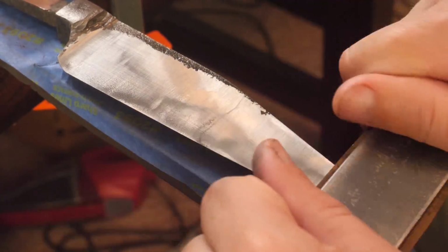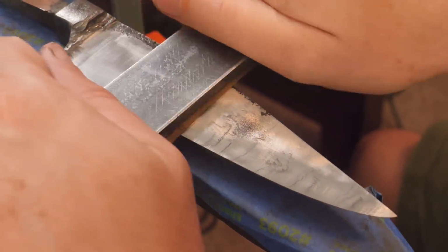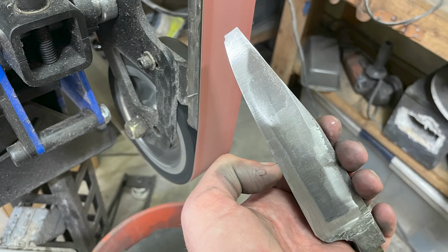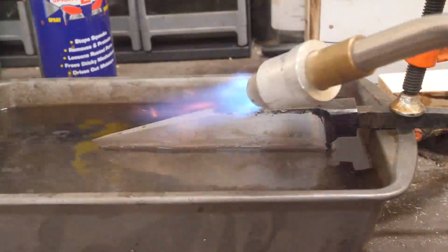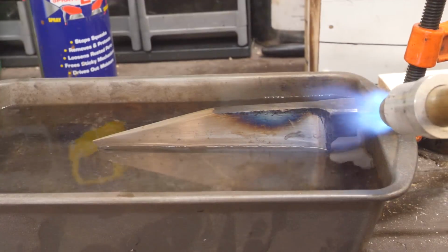Now oftentimes when hand sanding, one uncovers divots that require light grinding on the belt sander to get them out. In this case, I was done grinding out the divot, and I was moving the knife away from the grinder rather carelessly, and it got caught on the edge of the belt, which whipped it into the concrete, so I made a shorter knife. While I'm thinking about it, let's temper down the spine.